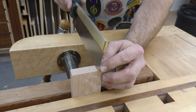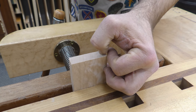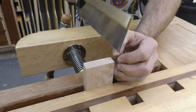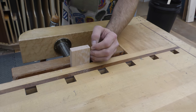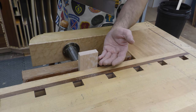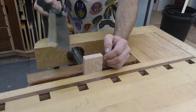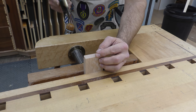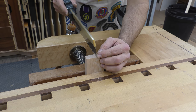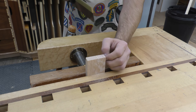Press the saw against the fingers, just use the first couple of inches — this is all you want to do, just enough to catch your thumb. Once you do that, you then move to the big teeth in the back, and that's where you get your speed. This cuts fast enough that you'll actually end up blowing past your line if you're not careful. When I cut the opposite way, I have to move my thumb out, use my index finger, again press laterally, use the first couple of inches to get it started, and then proceed with the big teeth — and there's your speed.